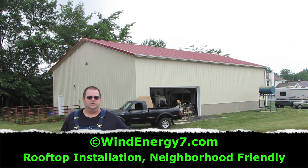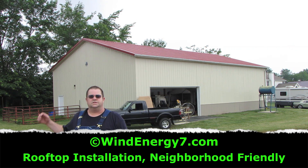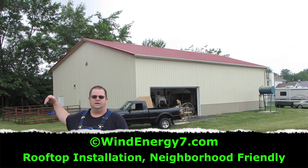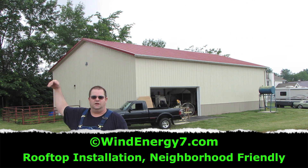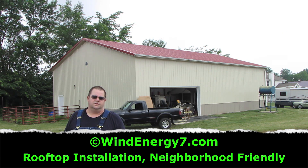We're going to put five turbines across the roof at 10 foot increments. And then across the southern wall of this barn we're going to put 10 solar panels in a solar awning that's going to be up about 12 feet off the ground, running across the length of the southern wall of this barn.